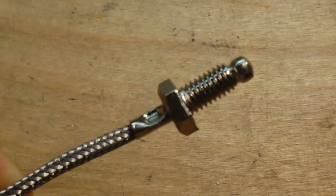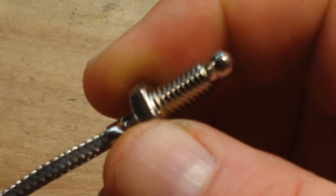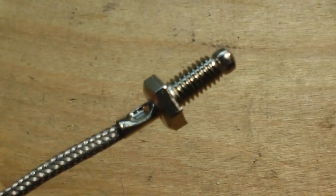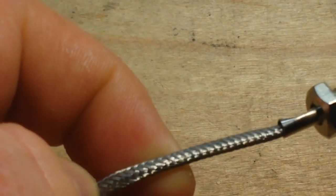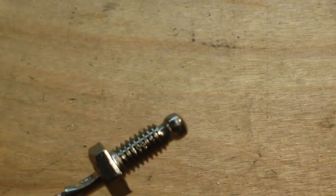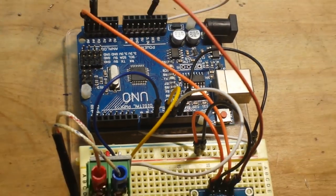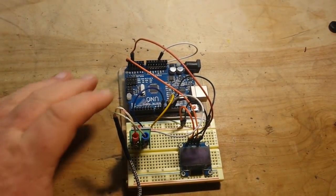That's why you want to talk about this — your basic K-type threaded industrial thermocouple. It's got a stainless steel jacket, you can put this inside most any project and it's going to last forever. But to make it work we need an amplifier and a library, and that's what we're going to talk about today. I've cooked up a little project for us.